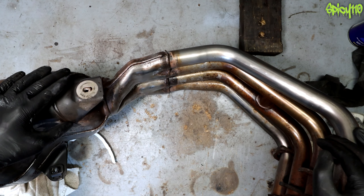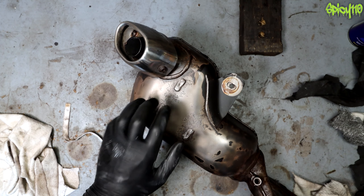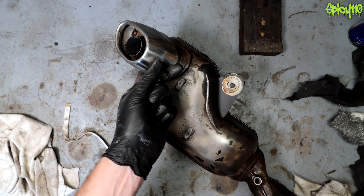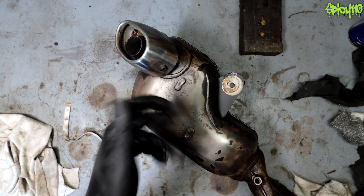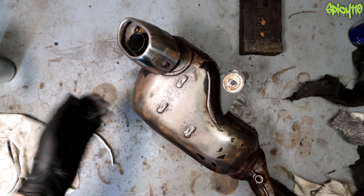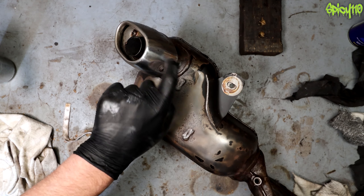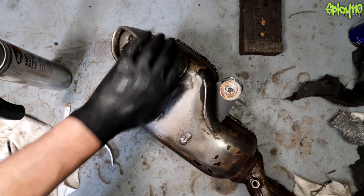I'm sorry the original video idea I teased didn't work out as planned — it's not really thumbnail-worthy. One other tip: if you have an end cap like this, they normally just screw on. When I went to take this off the first time it was properly stuck, and had I forced it those small fasteners would have snapped. If you have snapped them you can drill them out. But heat them up with a blowtorch, get some penetrating fluid — WD-40 or similar — heat up, let cool, repeat a couple of times to get that thermal differential going. Eventually they'll just undo. Don't force them. This end cap is actually stainless steel, so if it gets some tarnishing from the heat, just polish that off the same way as the main pipes.